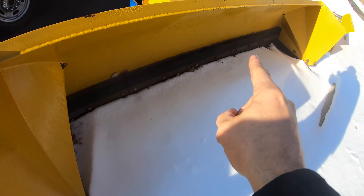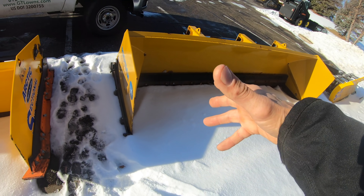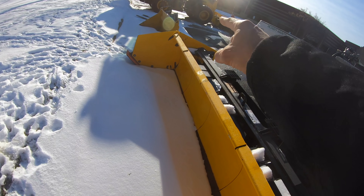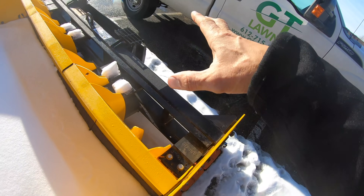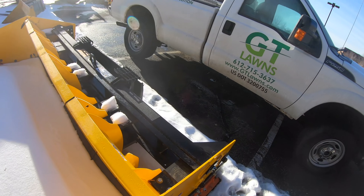Got to stop the video here because the Fusion Edge doesn't have sectional mold boards — it has a sectional edge. The mold board stays stationary and just this little flippity-floppity edge moves back and forth. On the Arctics, the entire mold board goes up and down — one, two, three, four, five sectional mold boards that go back and forth. This one has one, two, three, four sectional mold boards that raise and lower, which gives you a better scrape and the ability to contour even more to the ground.